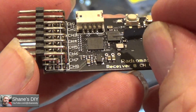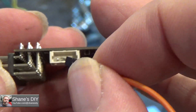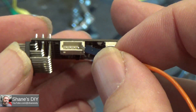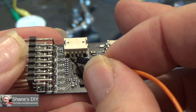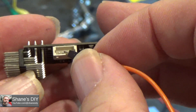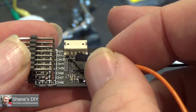To get flight pack voltage out of here, we are going to solder a wire to the far left pin. You could just get a new connector for this — I didn't want to buy a whole pack just to get that one extra pin. I could have moved the other pin but then I'd have to mess up the S-Bus connector and I didn't want to do that. So I figured it was easier to just solder a wire to that pin. If you're not comfortable doing that, you could try to find another connector or use the one included and just move a wire over.